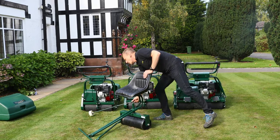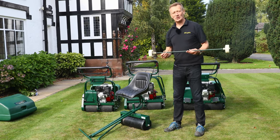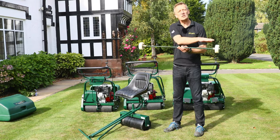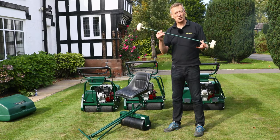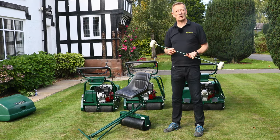The second option is a wheel kit for when you have trouble with longer grass — if you've been away and come back needing to mow long grass, you can remove the front roller and fit this wheel kit so you don't lay the grass down before the cylinder comes to mow it. That's a useful optional extra, available for all three models.